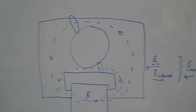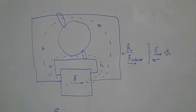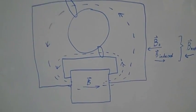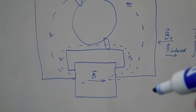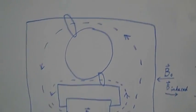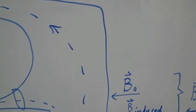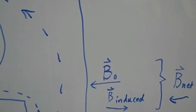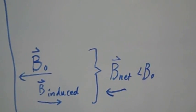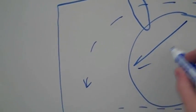When the current flips — because this is of course an AC motor, so the current is going to be changing direction at 60 hertz — you're going to get a magnetic field that's initially increasing to the right. So the magnetic field through the shading is going to be to the left, which means the induced magnetic field is going to be to the right. So you're going to get, again, a net magnetic field that's less than the initial magnetic field, and magnetic field lines going from the top right to the bottom left.